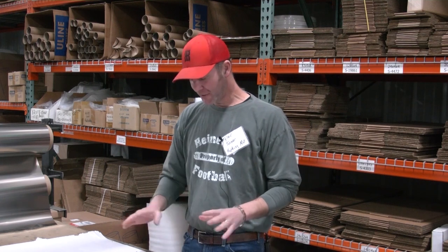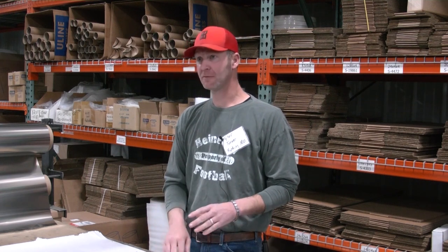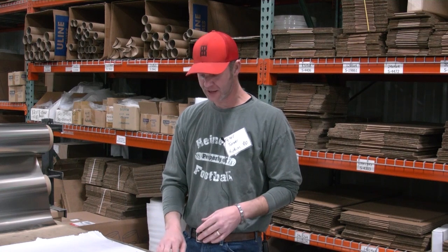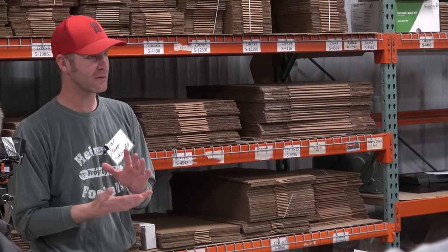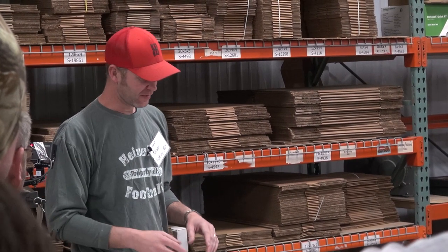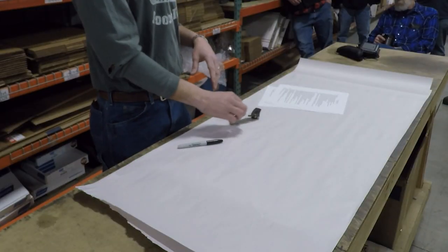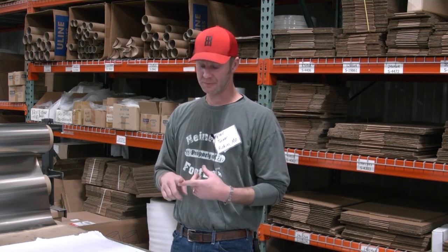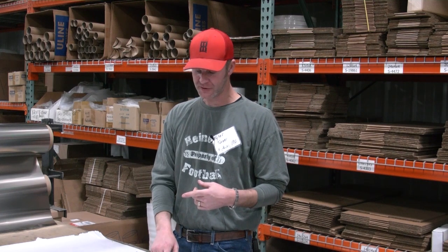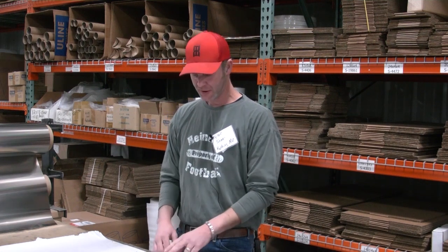So after you get everything straight, center punch everything on your template for your liners. Then what I do is super glue them together with the Loctite gel. Seems to work really good and hold good. And then I will drill out for the standoffs or your backspacer. You'll drill them with a 48 to start with, and if you want to use a 43 bit, that's a clearance hole for a 2-56 screw, number 43. That's if you're wanting to use standoffs, drill that.